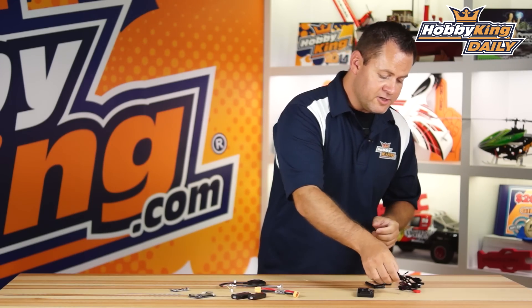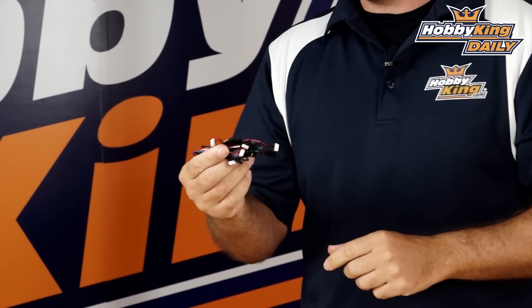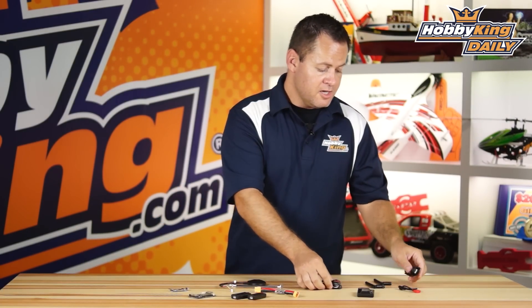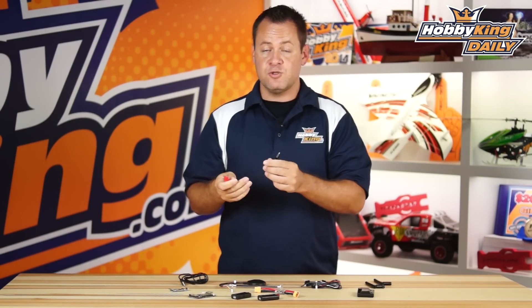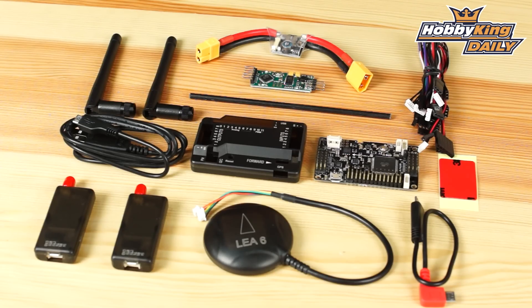All the plugs come pre-fitted with all the related proper connections, so this is a plug-and-play set. You pretty much can just wire it all up, plug it in, and you're good to go. It comes with the USB cabling for your computer or tablet to the flight controller itself, as well as an OTG cable, which is USB to USB, allowing you to use your radio with your computer or the flight controller to a tablet for programming. Of course, antennas for your telemetry radio — it comes in 915 or 433 MHz, so definitely check your specific region to find out what frequency is best for your telemetry radio band.